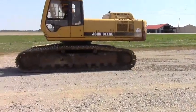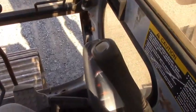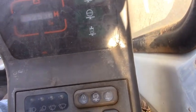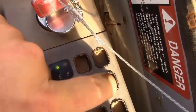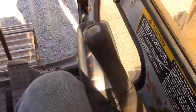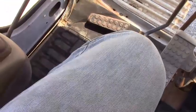We're going to go take a look inside the cab here guys and give you some more details on the throttle control motors. Show you inside the cab of this machine. Gauges seem to be working properly — showing 52-53 on the hours, no idea if that's right or even remotely right. See there on your throttle speed control, it's got idle, low economy and power — that all works. The stepping motor that controls the throttle over in the right-hand engine compartment is a little glitchy sometimes. Sometimes it works and occasionally it cuts out and stops working. The engine will idle up and that step motor has been working, but we can't get it to work today. So we're just showing you as is and buy it that way guys.